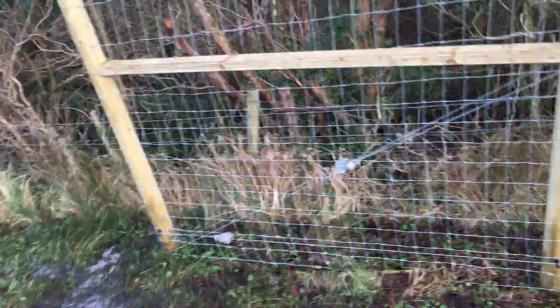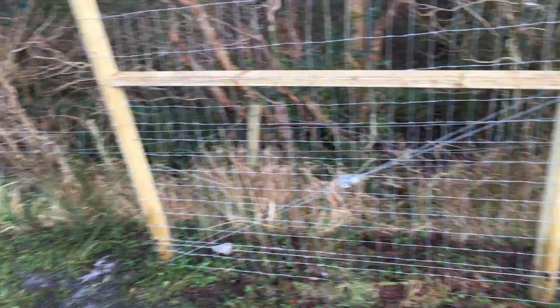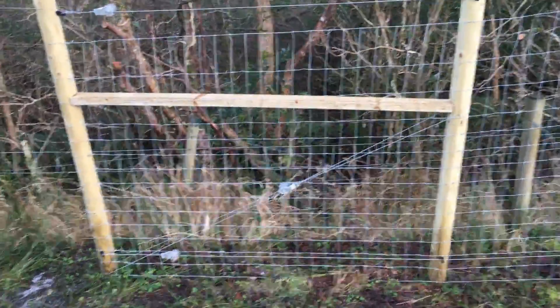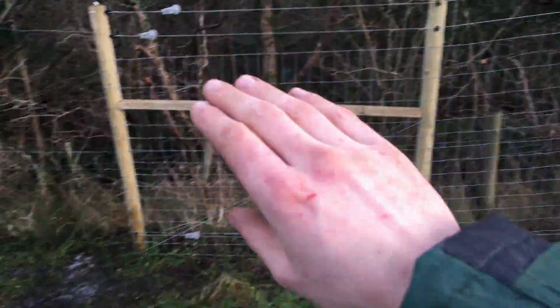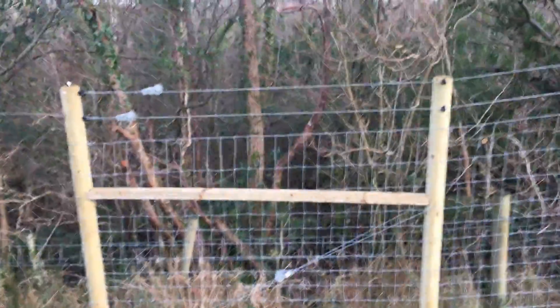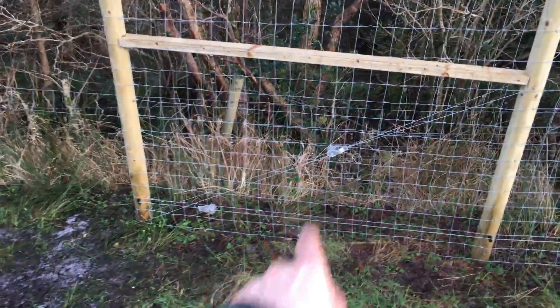This is the best part I find for corners. Here we've got a gate — I still have to install it — but this is an H-brace. From my reading, they typically recommend a 30-degree angle as optimal; I'm a little steeper than 30 degrees. The idea is all the tension is pulled on the top of that post, but because we've triangulated it, this post is held back by that wire. I think these are a solid job, and if it ever gets loose, all I've got to do is tighten up this little ratchet here to keep tension on the H-brace.